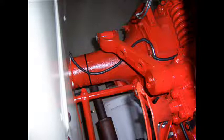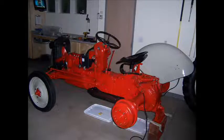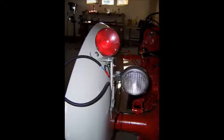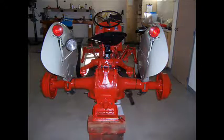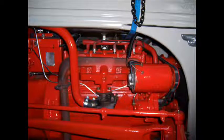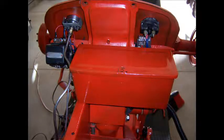There's only one wire running in this tubing — routed to the rear fender, up the fender, back through the fender hole, and out that hole to the tail light. Here's the left-hand fender installed with the wiring run to it, connected to the lights. There's also a work light and a switch back there, and none of these lights work unless the light switch is turned on — park lights only. Here's how I routed the wiring under the hood. This is the wiring that ultimately goes to the connector on the generator so that the lights turn on. I also used a little bit of fender molding between the side panel and the main hood itself. Here's the hood being put in place with detail of how I connected the headlight wiring to the main wiring on the tractor. Here's a photo of the toolbox with all the wiring in place ready to go.